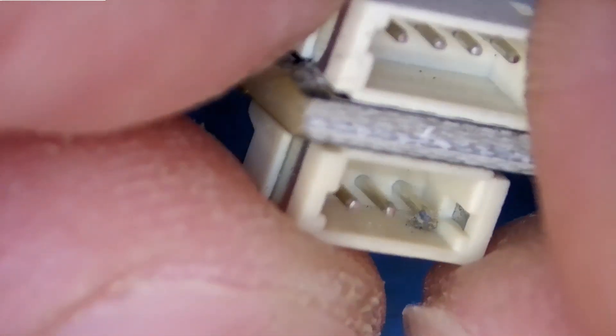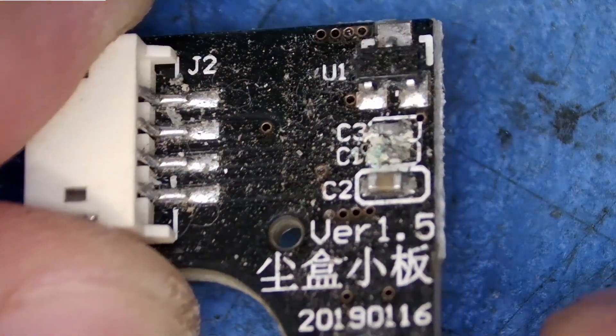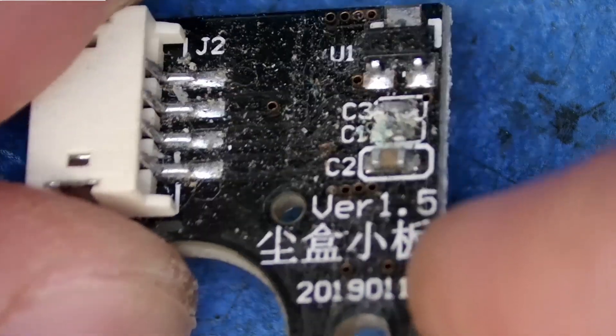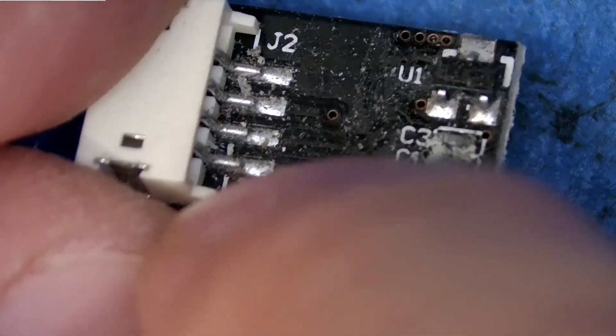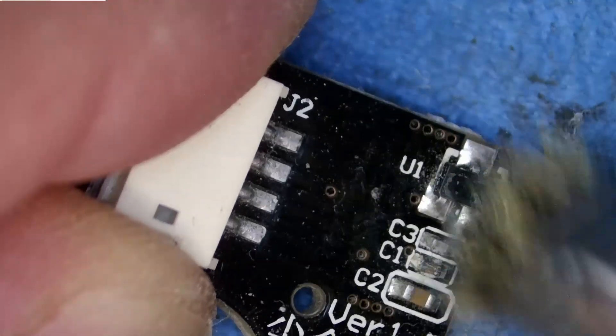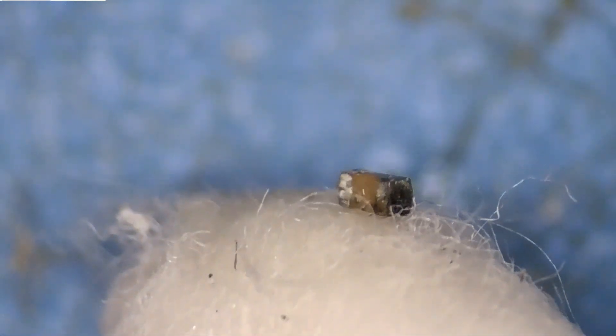That pin to the bottom right looks like it's got a bit of corrosion on it as well. How anything could corrode these components I have no idea, because the small pocket it sits in seems pretty shielded. There's dust on it, so it's not completely immune, but it seems a little unusual. I don't know if those little crystal-looking things are going to be like salt or something. Let's brush some of this off and see what kind of damage we're looking at. That capacitor definitely does not appear to be in good shape. I was cleaning the board with a cotton swab and some isopropyl alcohol and that capacitor completely broke off — it fell off onto the bench. So yeah, that capacitor is definitely a goner.